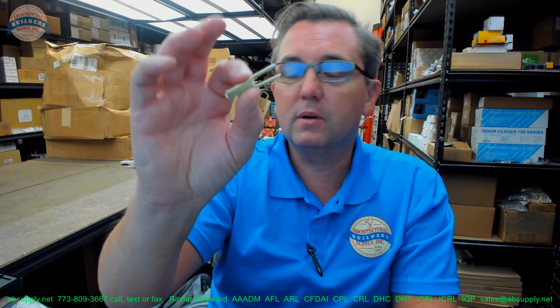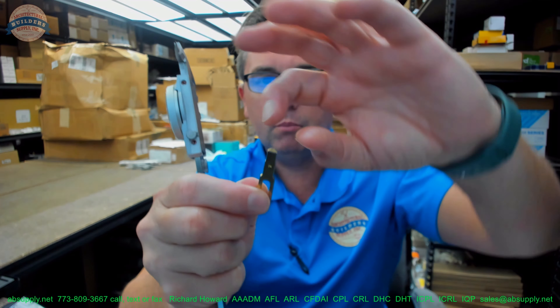Let's give you some basic dimensional properties. A lot of people will call these a tuning fork — you can certainly see why. The overall length of this 7-pin unit is 1.663 inches. It's stepped, as you might be able to see here. The wider portion is 0.255 inches and the narrower portion is 0.232 inches.